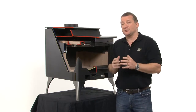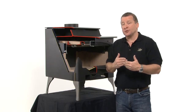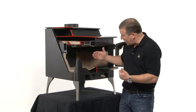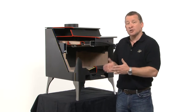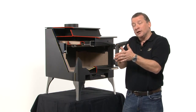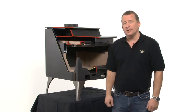The preheated air is really the key to it. Air flow itself, if it was just room temperature air, wouldn't be as effective at keeping the glass clean. It's the preheated air that helps that glass stay really clean. That air comes down across the glass then into the fire as primary combustion air. So it's always fresh preheated air going across that glass — that's what keeps a barrier between the glass and that fire, and it also keeps that glass hot, which is what keeps it clean. It works really well.